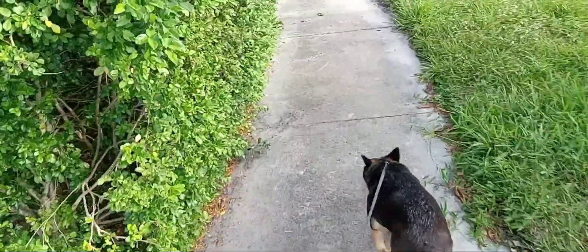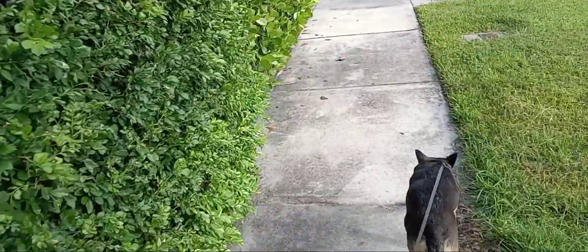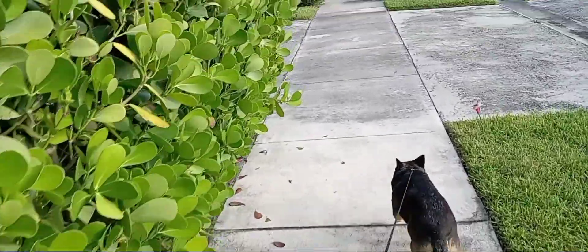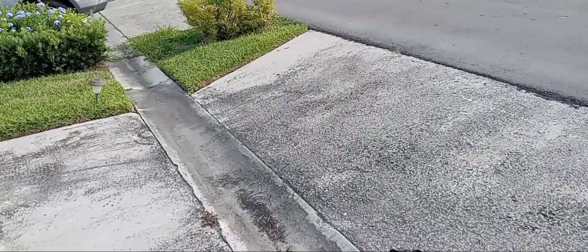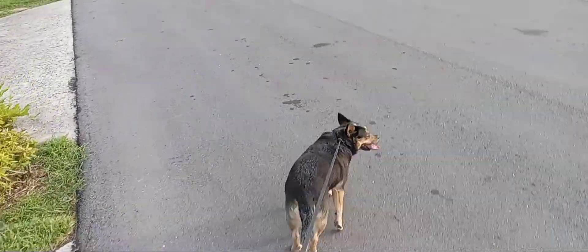So first, the stain is trash. For another 20 bucks for a five-gallon bucket, you can get driveway paint, which is a little bit better — as long as the prep is done right, it's not so bad. And then there's another $25 to $35 above that, and it's a one-part epoxy driveway paint, which is really good and lasts a long time.